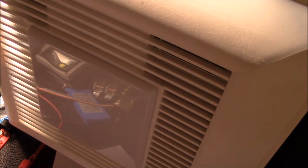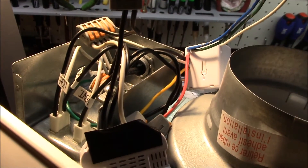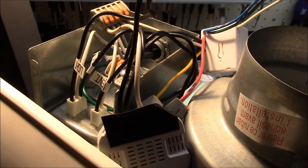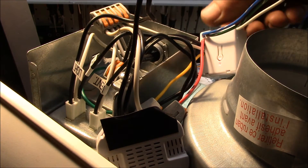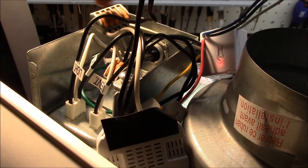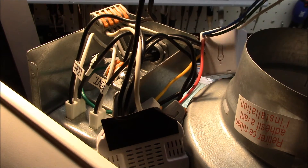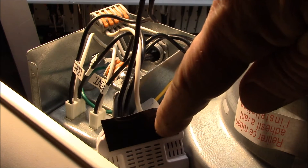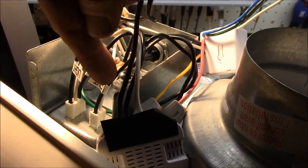Let me show you how I'm going to automate this light. I'm going to try to fit all of the electronics into the wiring box. I've got a bunch of WAGO connectors — the lever nut style. There's a five-pin for the neutrals: the incoming neutral, a neutral going to my light dimmer (an Aeotec light dimmer module), a neutral going to the Monoprice dual relay module, and then neutrals that go to the lights and to the fan.